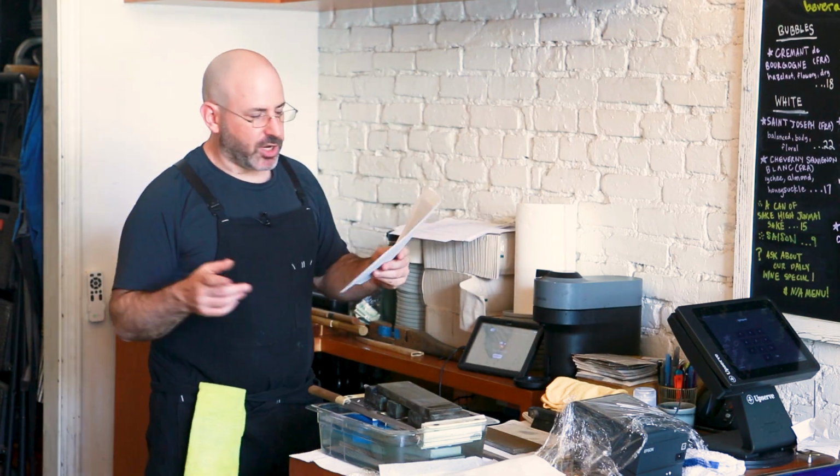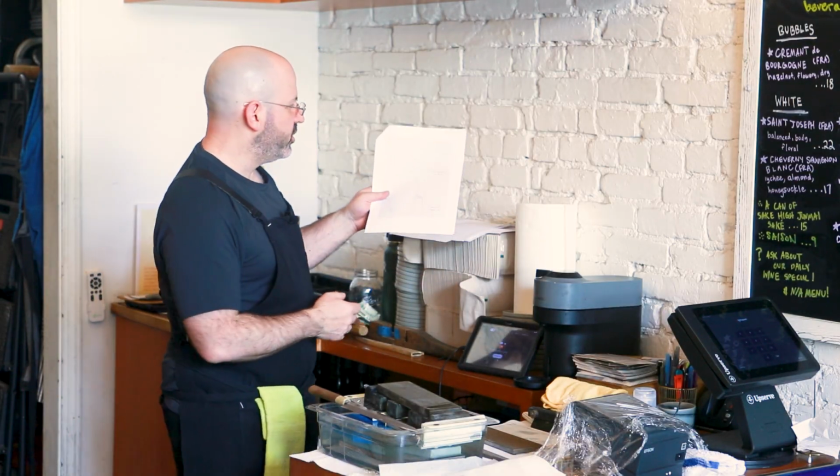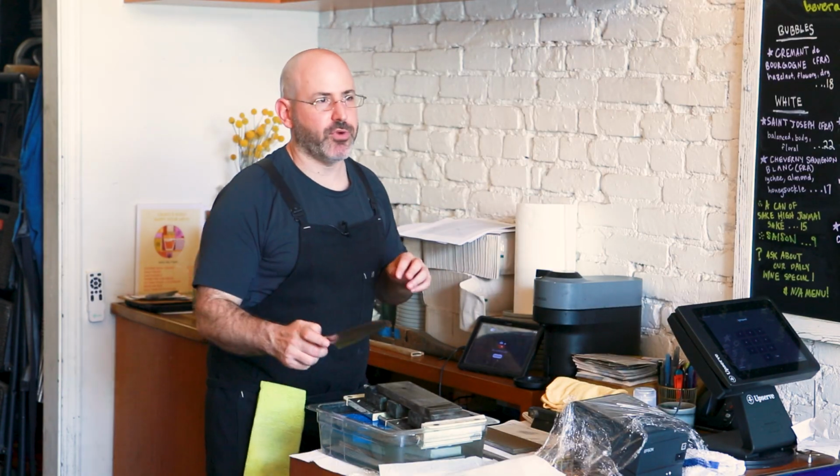So again, we're going to go over hamaguri sharpening. And much like I was talking about before, we are going to go through our three-stone setup. So this is what it's going to look like. We're going to do the upper section of the bevel, so from the shinogi line down to roughly the lamination line, coarse stone. And then from the lamination line down to the edge, coarse stone. And we're going to do that by applying pressure differently.